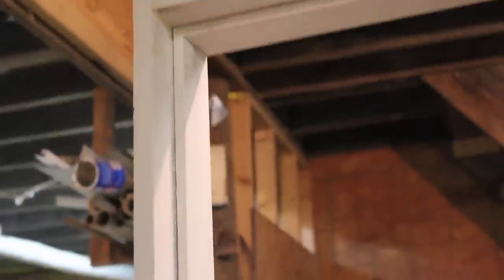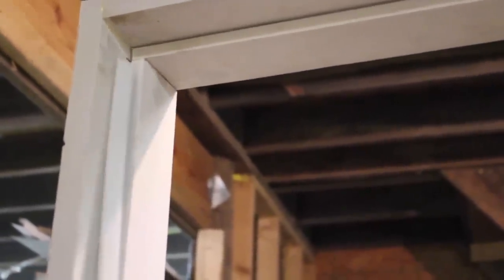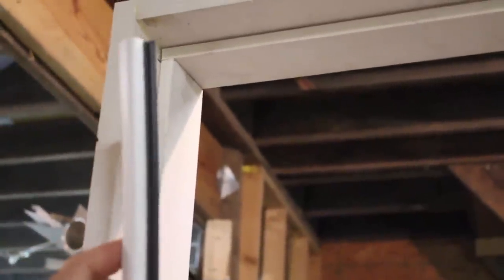You can see up here at the top where I've got it put together - you can see why we knocked that little corner out so that the trim work goes in and around the corner. The trim slides right up in there, the black part slides into the groove and locks in - that's what creates your seal when you shut your door against the jamb. On the other side we've done exactly the same thing, and my hinges are all dado'd in.